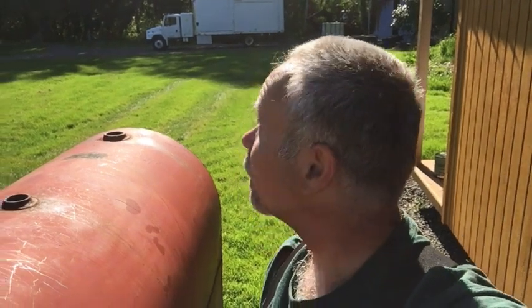Okay, another look at the inside to make sure it's dry. The rust didn't flash off as bad this time as it did with the muriatic acid. Phosphoric acid doesn't seem like it's as aggressive as the muriatic acid is. Now the tank is actually hot to the touch. We have the exhaust from the truck running into the tank, but it's warm. We also have the sun having this nice and warm. I think that might help me out in my setting time.